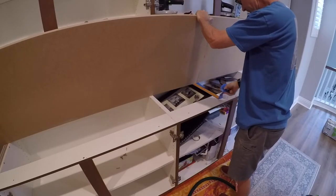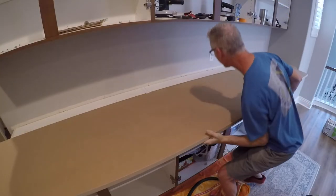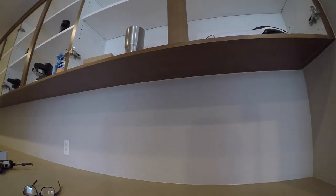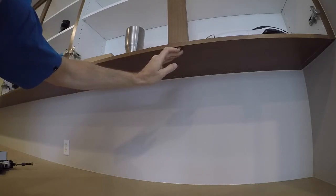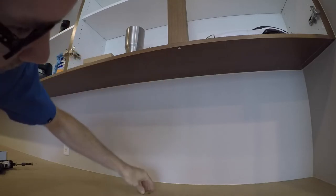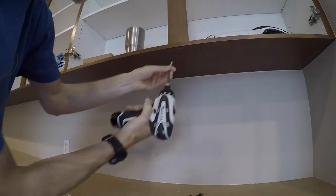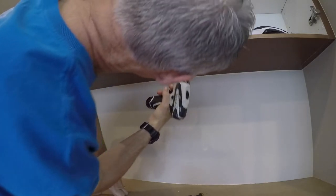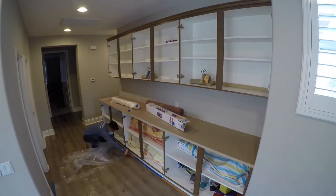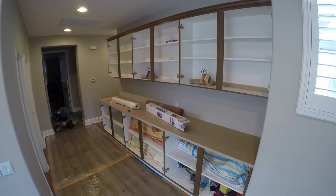I need to remove this tape, lift this up — it's a little bit heavy but it's got to be done. Before I'm done there's one more thing I want to do: I want to pop this little plastic bun off, increase this counter-bore, and drive that screw back in so it's set below the surface so the finishers can fill it and you'll never see it.